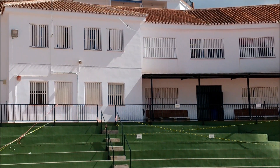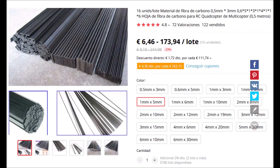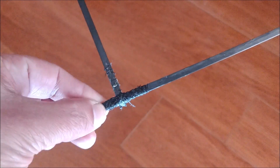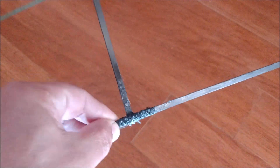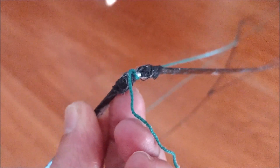We have built a slow-flying aircraft made of carbon fiber strips and cling film. We need carbon fiber strips 500 mm long, 5 mm wide and 1 mm thick. The wings are formed by joining two strips lengthwise, making two rectangles. The joints between the strips are made with cyanoacrylate glue and sewing thread. The overall dimensions of the wings are 19 by 98 cm, giving a wing area of 0.1862 m².